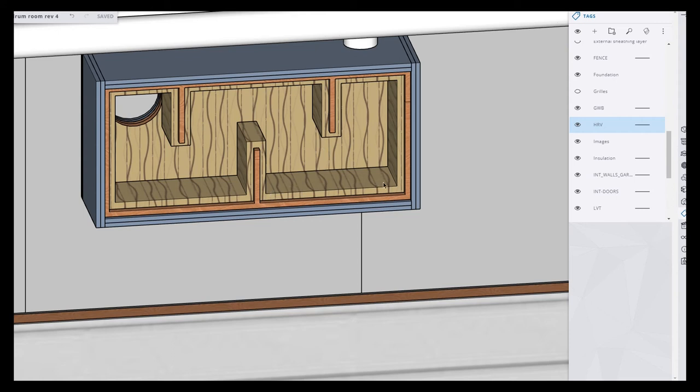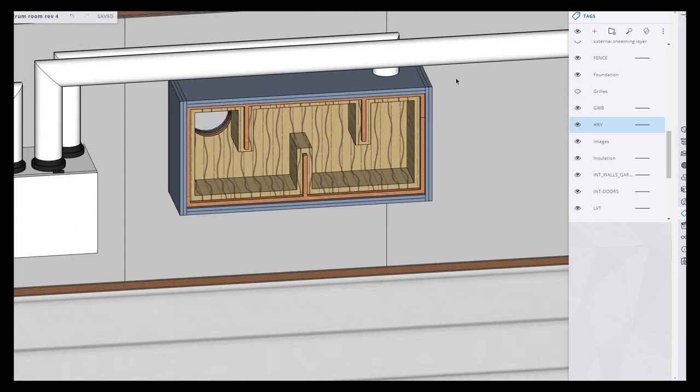Inside would be some insulation, rigid fiberglass. Owens Corning makes a product called OC703, which is a rigid fiberglass board. This is a 1-inch board that helps attenuate noise as the waves pass through here. Inside of a plywood box, and then essentially on the outside of the box are two layers of drywall, similar to the wall construction. And really this is to continue that construction material on the box.